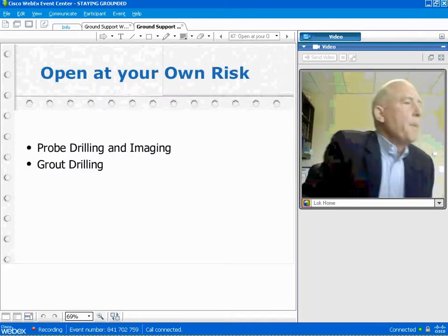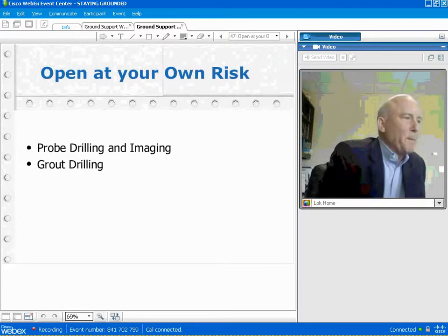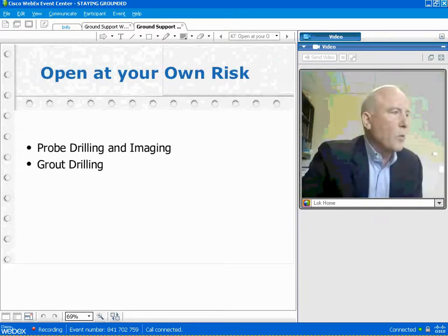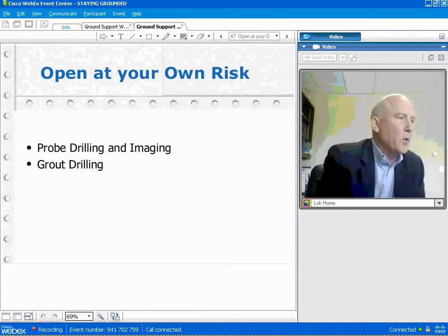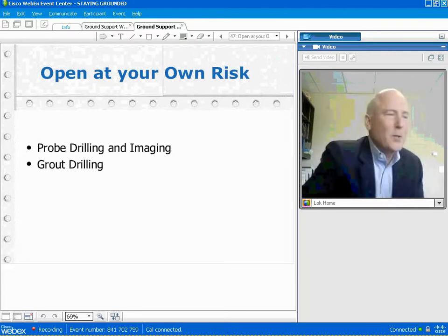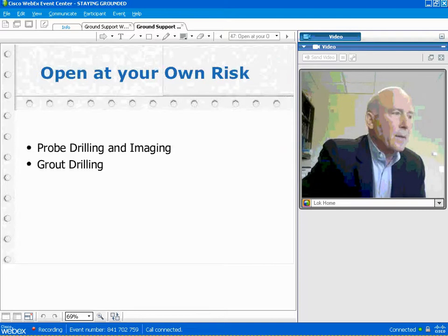You know, this is titled Open at Your Own Risk, probe drilling, imaging, and grouting. Open at your own risk is when we bore into a fault zone or some very difficult ground and something bad is about to happen to you. So that's why we promote a lot of probe drilling, continuous probe drilling.